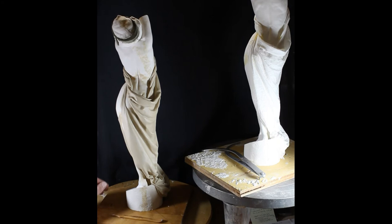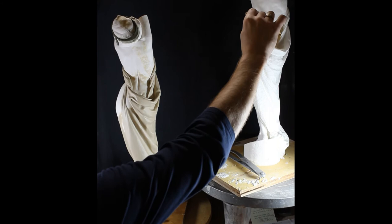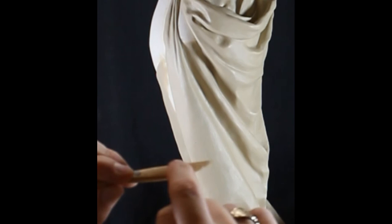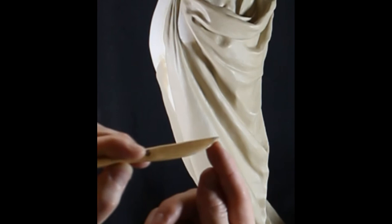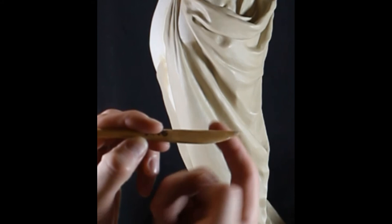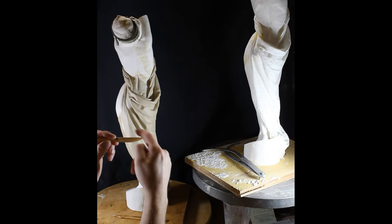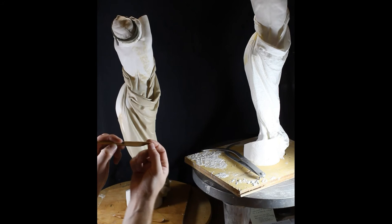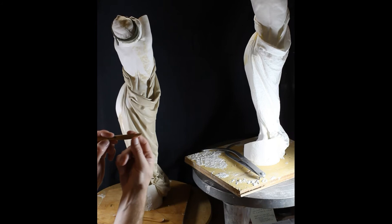Something to really think about is, let's just say this piece of wood represents a type of cross section from the mold, and that's in there. Well, if this is the rubber and you're casting material in here, this is such a small point. Your casting material never wants to stay on there. It would rather stay on a flat plane. So this is going to represent a weak point if your material casts over it. And especially in waxes, when you're trying to cast a wax, this part gets hotter faster, for obvious reasons, than the thicker part. So the wax doesn't solidify on there, and you can pull a wax out and have maybe, you know, a quarter of an inch thick, and this will be paper thin.